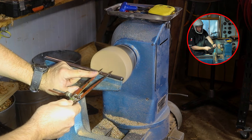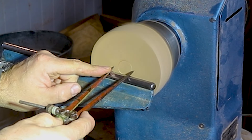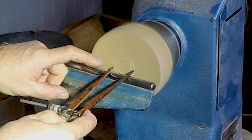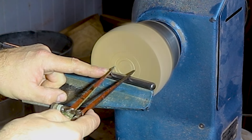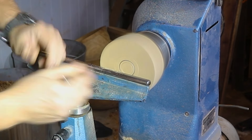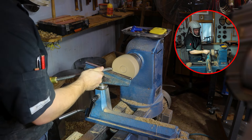As we all know, left side touches, right side shadows, so I'm just going to make a mark. That's way off, so I need to go back to the left because it's on the inside of the right-hand marker. I'll make one that's going to be on the outside - I need to go to the right of that side and there we're bang on. So that's our tenon there to form up, and I'll show you how I cut it.